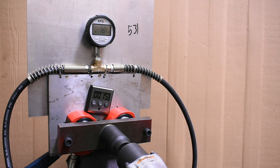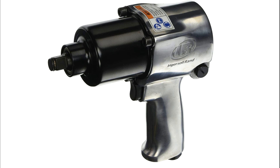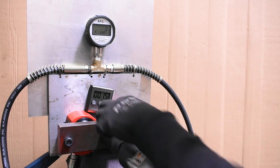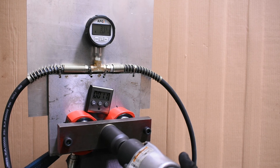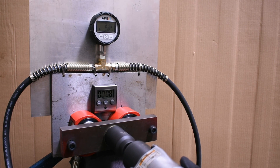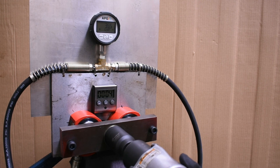So what have we learned? We've learned that the test rig itself is repeatable and reliable, which is mainly what we need from it. The accuracy is coming from this 231H being 450 foot-pounds — and if this is 450 foot-pounds, is the next impact we test one-and-a-half times more powerful, or half as powerful? That's going to be our scale, which is more relatable to the average user than some formula manufacturers use. We also have a ceiling — a best-case scenario — and hopefully we can compare that more directly with the best-case numbers from other brands. Future videos will be considerably shorter since I won't have to build the test machine each time, and there'll be actual comparisons of impacts against each other and against this standard.